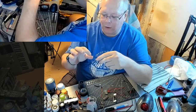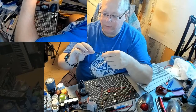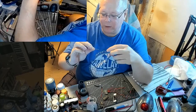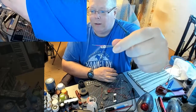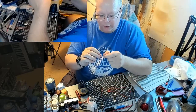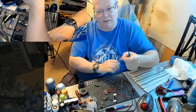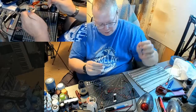Now I'm going to hold the wire on the LED like this, and then all I do is twist. I don't have to put a lot of pressure. I'm not really pushing very much. All I'm doing is twisting it. I do that a few times and it finally comes loose. Now that wire is perfectly wrapped around that little rod, and it's tight, it doesn't go anywhere. At the same time, I don't want to play with it too much because this single strand wire is a little bit brittle. If you bend it too much, it will break. So now that that's done,